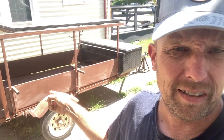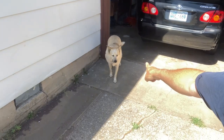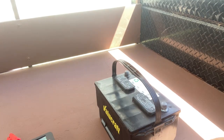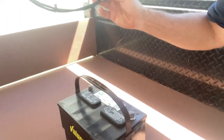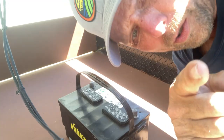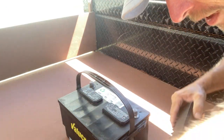The mighty maxes are great, but we're out here with the chuck wagon I built. It's dusty, but it's got a 370-watt panel up there. I shouldn't be able to get more than 240 watts out of the 370 anyway — that's why it's a little overkill. Say hi to the pup — everybody likes a dog! Underneath here, I've got the XT60s coming right off the panel.